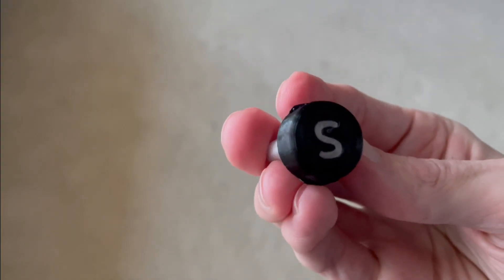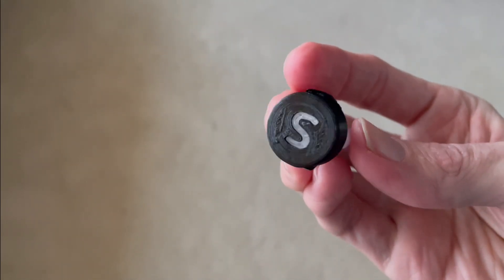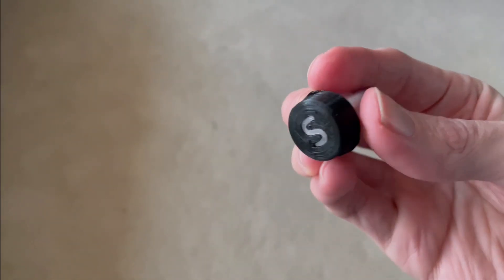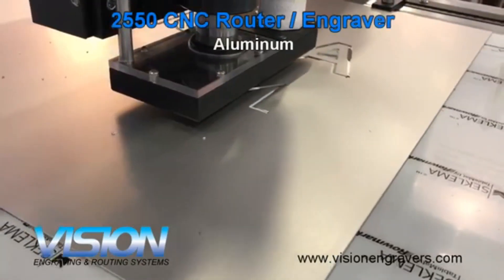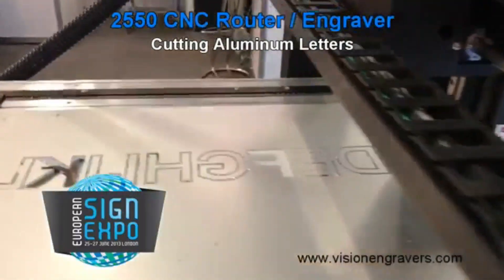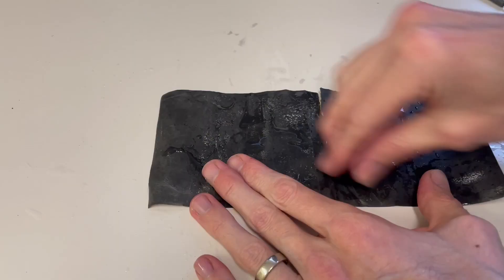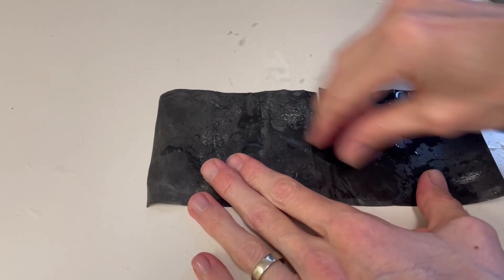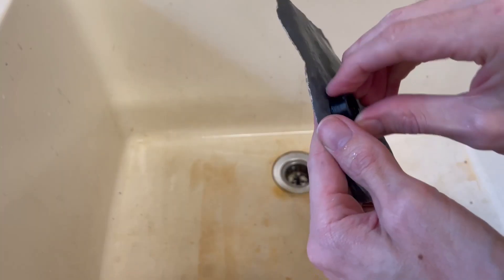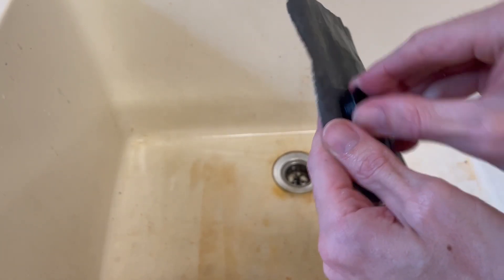The benefit of this design is that the entire cap can be a solid finish — the plastic can be wet sanded with no painting required, so it will never wear off and definitely will not mess up the lettering. In fact, the cap part could be CNC machined out of aluminum and powder coated or anodized for a very strong metal finish. For this case, the cap was printed in PETG and I wet sanded from 300 grit up to 1000 grit to give a matte black finish. I found that starting with dry sandpaper would really ruin the plastic, so make sure to use all wet sanding.